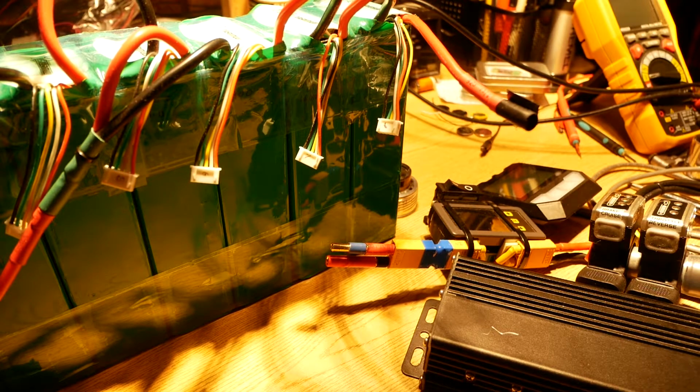And yet this is something that's important because every time you plug in and unplug your battery pack from the wheel, you are making a nice big arc. This is called inrush current, and it's damaging the electronics. It doesn't hurt the batteries, it doesn't hurt the capacitors, but it hurts everything else. It doesn't hurt the motor. But all the small electronics, everything else in the wheel, is slowly getting damaged because of large spikes of voltage on the electrical buses that are created because of this sudden inrush current.